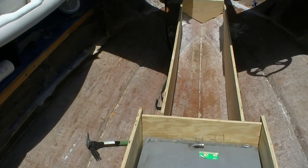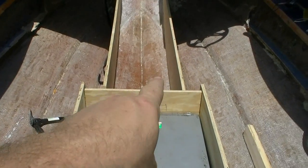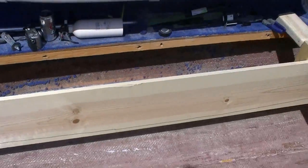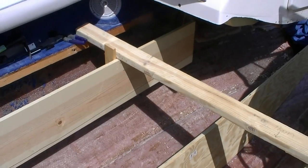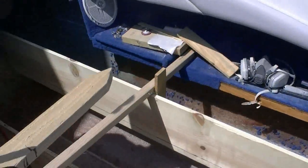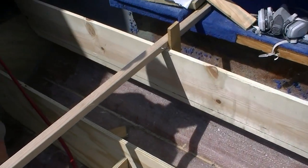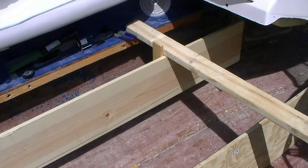I asked the question on iBoats.com, and hopefully somebody will respond that pine is okay — because my Glastron is all pine and it's been around since 1981. I'm going to go ahead and pull these two stringers out, cut them down, and do a dry fit to make sure they're okay before we move forward. So we're doing the side stringers now. I got a nice big piece of white wood, which is a higher-grade pine. I probably should have got Douglas fir, but to order that would have taken forever, and I'm going to encase this and soak it in resin so I'm not too worried about it. I supported it across the hull level to the other stringers, then used my pin method to follow the hull, and now we'll take it out, cut it with a jigsaw, and see how it fits.